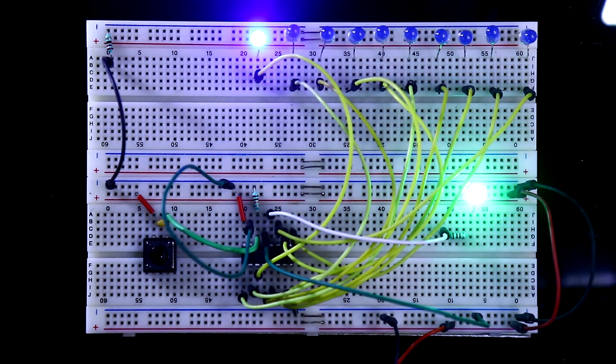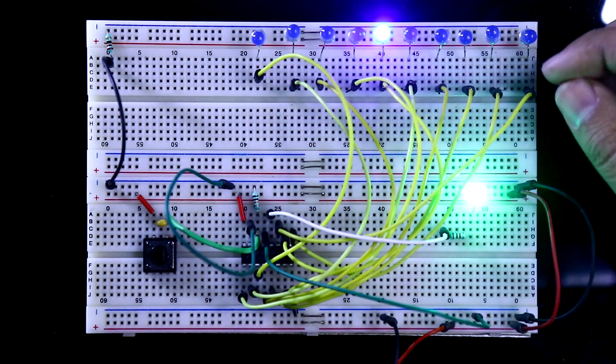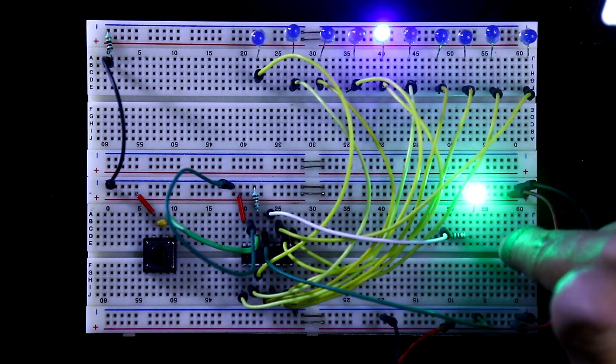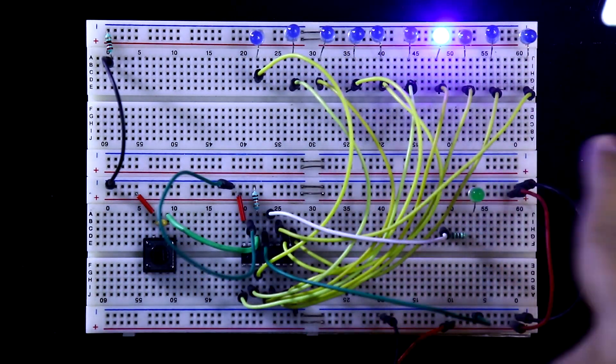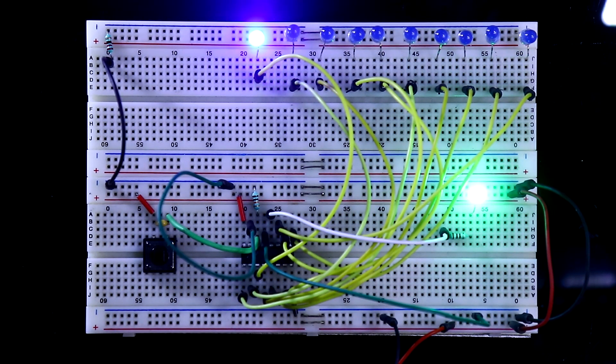This carry out pin, or pin 12, can be connected to the next IC4017 or any other IC if you want to divide the input frequency by 10. Each individual output can divide by 10 but has a 10% duty cycle. Pin 12 however has a 50% duty cycle — 50% activated and 50% deactivated. So this is the function of pin number 12. This is all about the basic things of IC4017. In the next video we will discuss how to cascade this IC4017. Till then stay happy and thanks for watching.